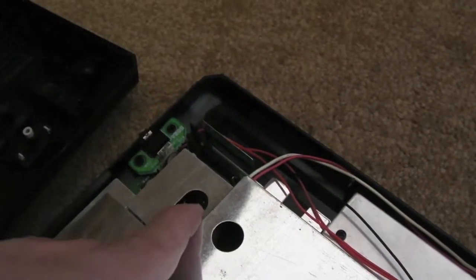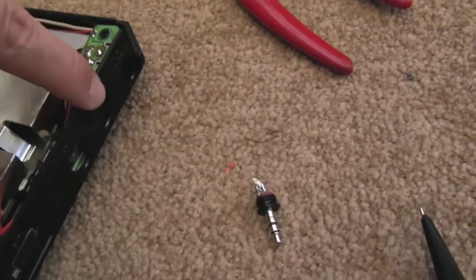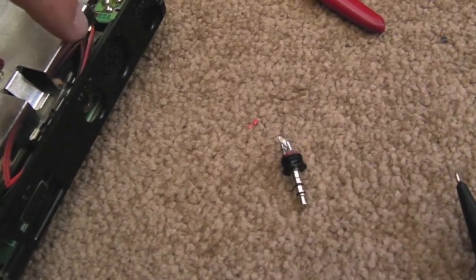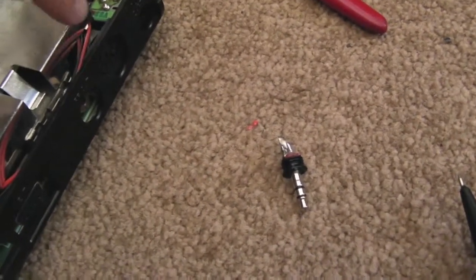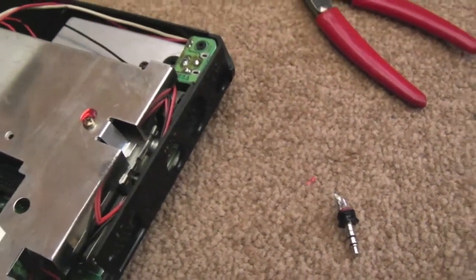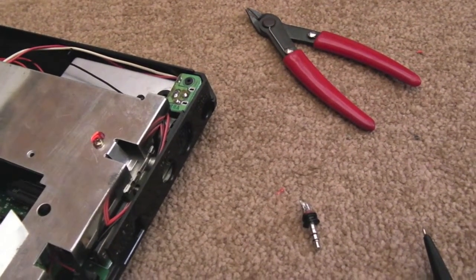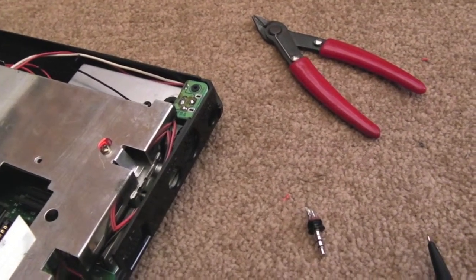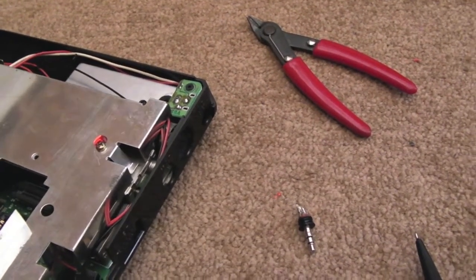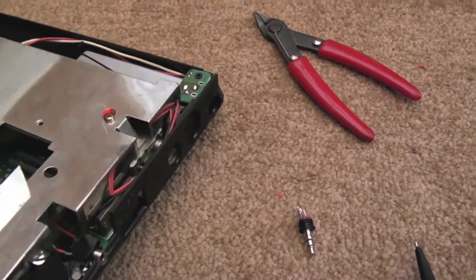If you want a proper line out, feed it into one of the pins — say the left channel into pin A — cut the normal mono audio channel on there and feed the right pin into that. Then modify the cable that comes with it: on the SCART, the plus 5-volt is on most of those adapters going to the 12-volt switching line, which effectively just switches the TV channel automatically when you power the console on. You could live without that and hijack that 5-volt line.